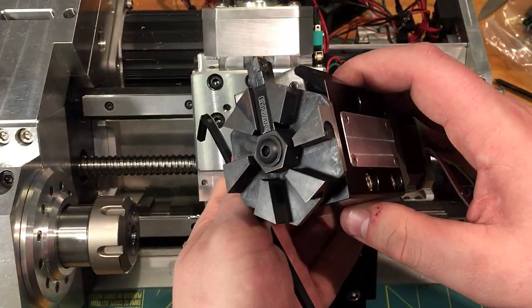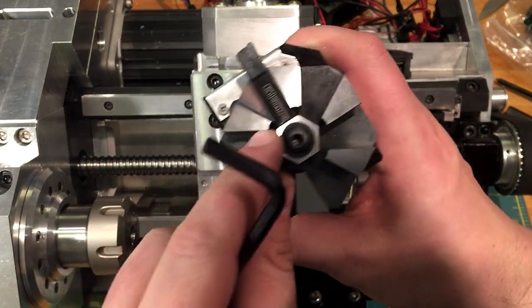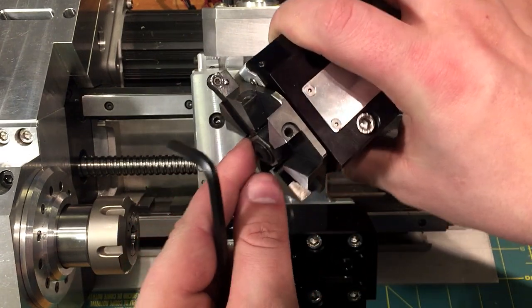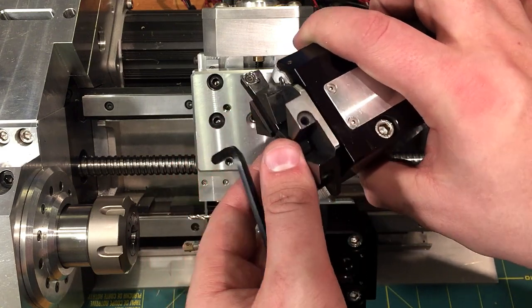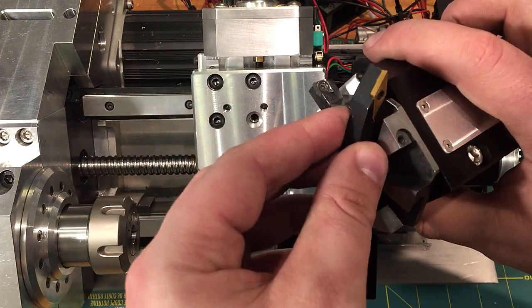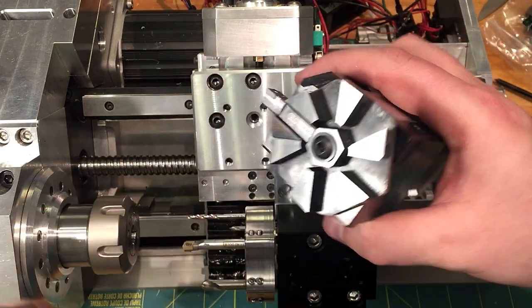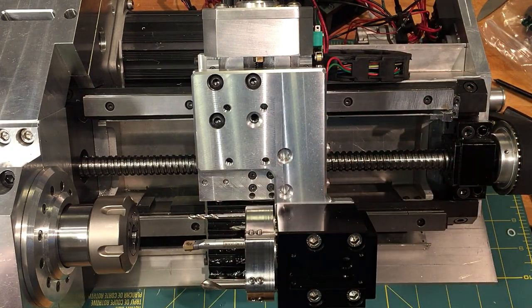So there's the turning tool holder. You can see it's sort of a wedge lock system that holds the tools in. That's not rust — that's colored oxidation. I just heat treated some wedges today so I can start loading this guy up with tools. This is just the CCMT right-hand tool. I've got one of these — I think it's a VNMG — that I'm hoping to put in, and maybe a left-hand tool, probably a parting tool, threading tool. I think I'll fill it up pretty quickly. No live tools yet.